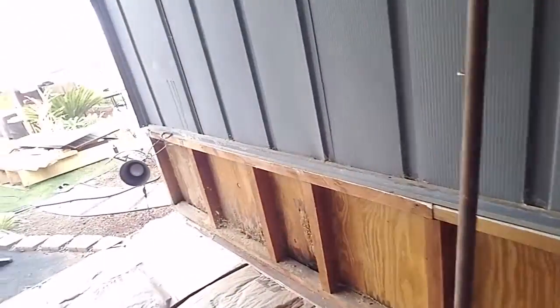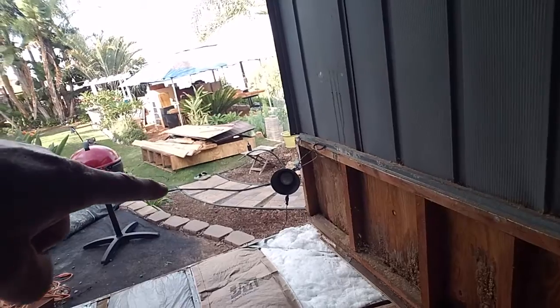Anyways, that's a good start for what's gotta go on. Rip the skirt, try to access all the subfloor on this side in particular. We're pretty good — the wood is pretty darn good until it gets to the front edge. Maybe a little piece of Masonite or something I can rip to fill that little gap space that the skill saw couldn't manage. Level out that gap — self-leveling might also help as a sealant to keep moisture out. Don't want any modes of ingress and weak spots.